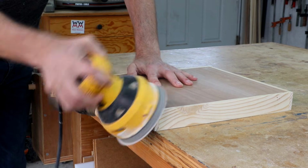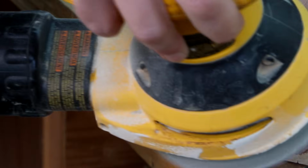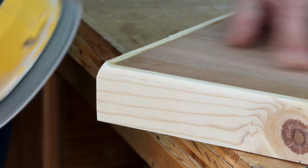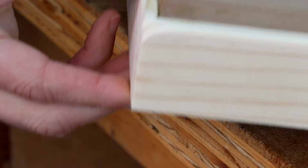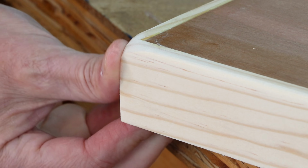This is a really common one. A sander is a simple way to ease over the sharp edges of a tabletop. If you're gonna do this, pay close attention to the corners. It's very tempting to maintain the same sanding motion and just hit those corners, right? Well, 2 things can happen. First, you're a bit too enthusiastic and you basically remove the corner. It only takes a power sander a second to just nerf that corner. Sure, it won't poke an eye out, but rounded corners can look kind of weird.